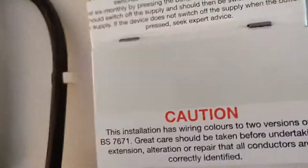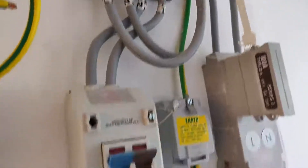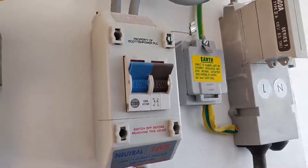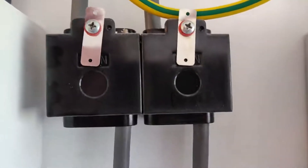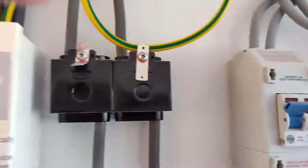This is the outgoing steel wire armoured cable which goes off to the charging unit itself. When I ran the SWA cable I also pulled in a Cat5e cable alongside it, which will connect to the CT clamp. I'll cut the connector off that end of the cable and only use a couple of pairs out of it. The CT clamp will go somewhere on the incoming live connection. There's an isolator there and a couple of Henley blocks. I haven't connected the new consumer unit yet — that's a job for a qualified electrician. We're going to have an electrician visit in the next day or two to do all the electrical works at the consumer board.